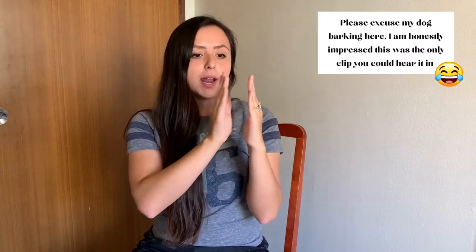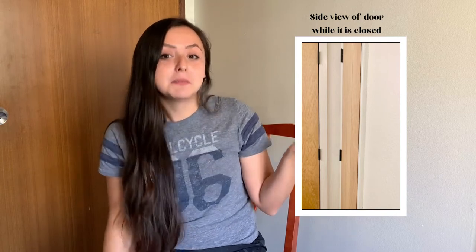The majority of questions I received were about this precise part. You can move the door jamb for the added amount of wood on that side, but what happens is that your hinge stays in the same place, so when you add to the opposite side, people believe there's going to be a bulge out. This is what it looks like in my house — we have very thin trim. You don't really see much of an issue because what we've added is not even quite a quarter inch thickness. However, there are jigs you can buy to move the hinge back a quarter inch if you wanted to — that's totally up to you.